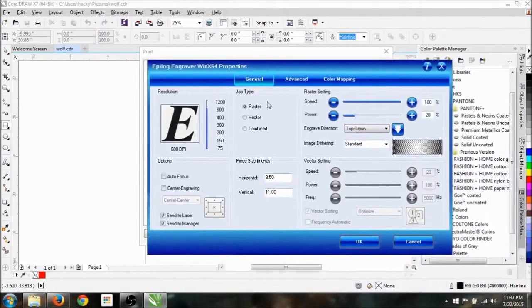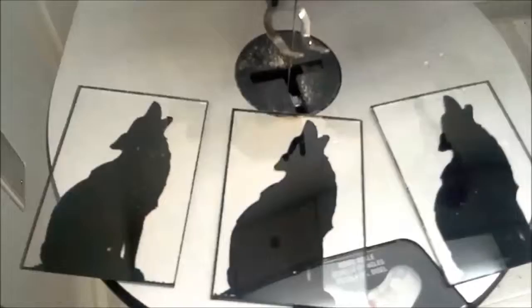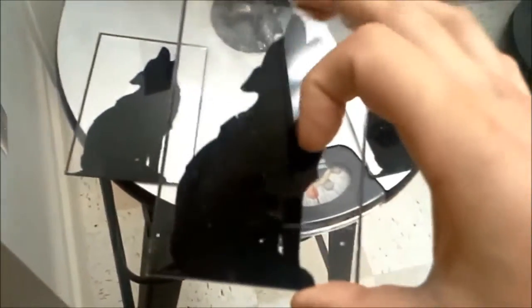We're going to raster this at 20, 30, and 40% and see what it looks like. This has been much more successful than I thought. This is the back side — all those imperfections are just scuffs I put on there. This is a mirror finish. At 20%, there aren't any noticeable outlines and the small detail hasn't been covered. At 25%, this small hole is a little bit smaller because of the ridges.